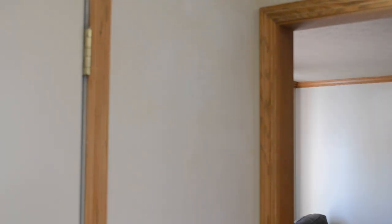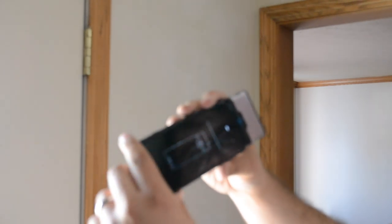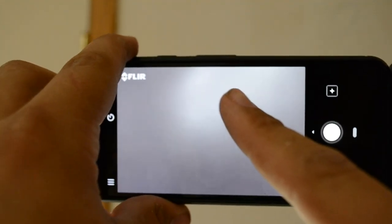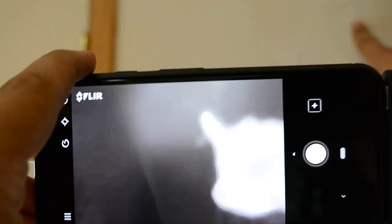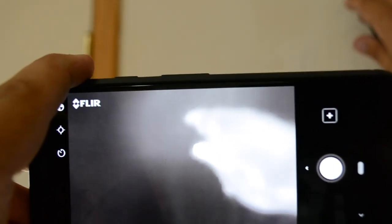Here I'm moving the camera to the inside wall and you can see me turning on the infrared camera. It's detachable and plugs into USB-C. You turn it on and it has to warm up for a little bit — that's the loading screen you can see. Now you can see the camera. That white spot right there is what the nest is — that's the heat signature. The infrared picks up that heat signature. Once you find it, you take a pen and mark the spot on the wall where you'll get directly into the nest.